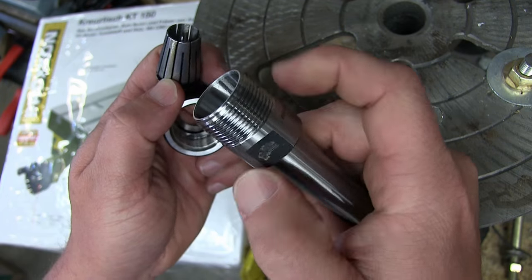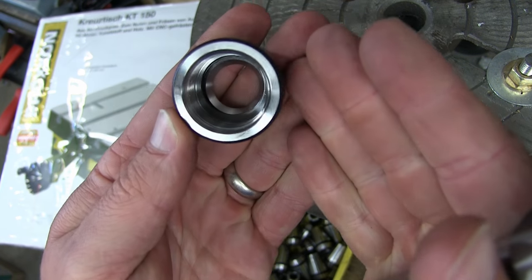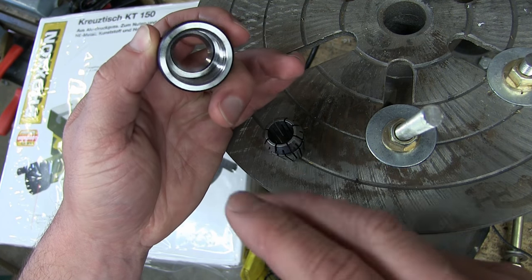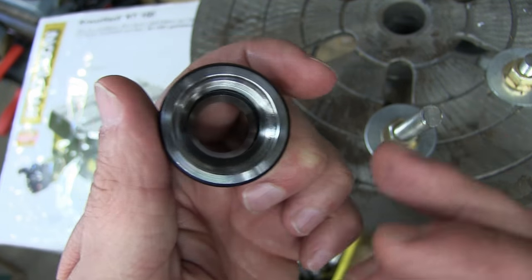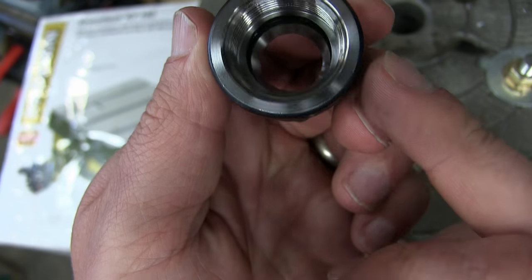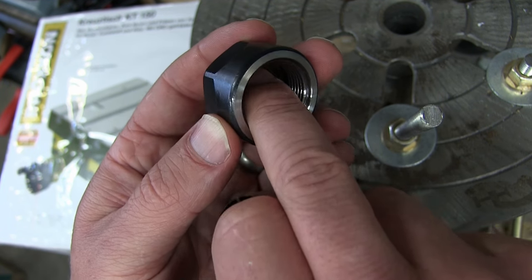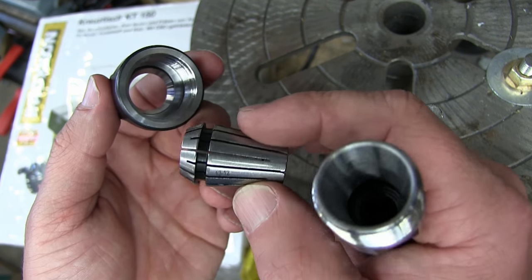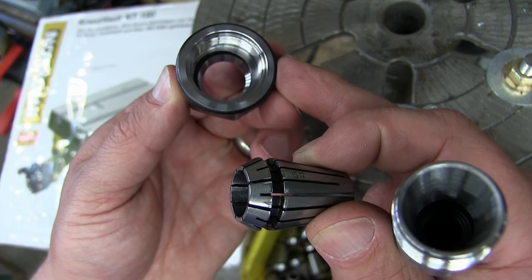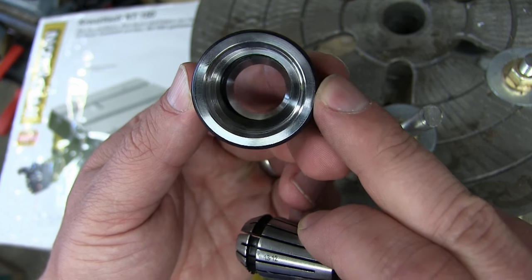This is the same kind of thing that you'd buy from Grizzly tools. Of course, there's no point in buying from Grizzly, as we saw with that cracked bullnose. AliExpress — this is obviously an outlet for backdoor stuff, third-shift stuff out of Chinese factories that doesn't meet QC. Check it out, see the taper there? It's right Daddy Wampus — the collet's not even engaging on that taper. Instead, it's hitting this offset here. So if you buy this and expect to use it right off the hop, you are sorely mistaken. You can see the distance there — just right off in the rhubarb.